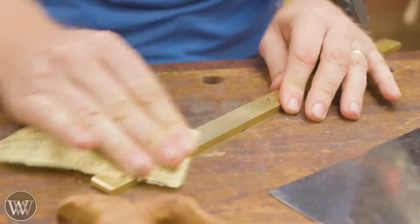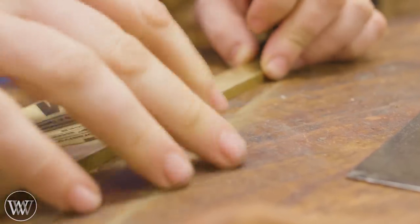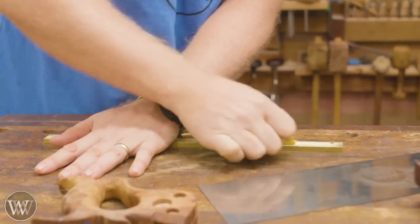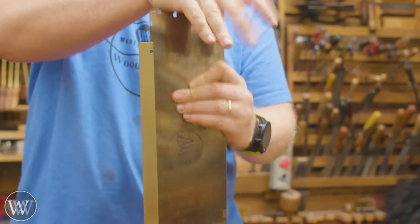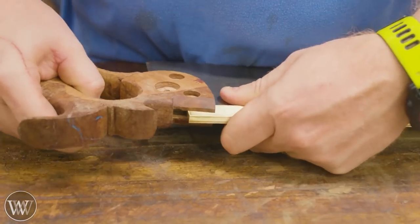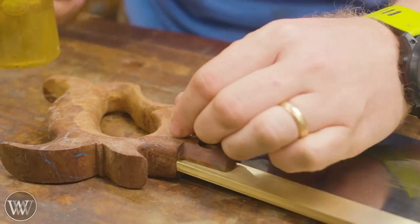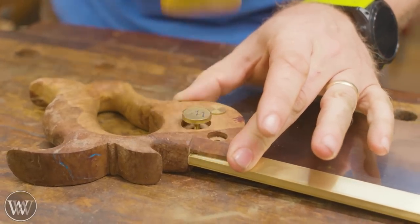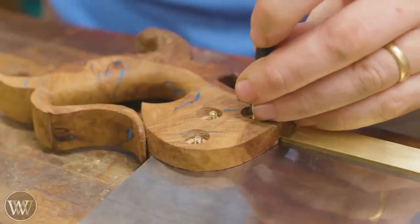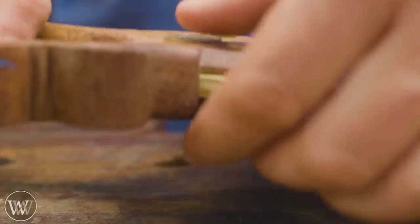I want nice, clean teeth on here. On mine I'm making it into a tenon saw. On the other two for Alex, I'm going to make those into a tenon saw and a sash saw - so a matching pair on those. The brass has oxidation on there, so I'm going to come in and sand that off with some 400 grit and leave a brushed look on there. This one is actually not a folded back - it's a cut back from Blackburn Toolworks, and I need to epoxy this one in place rather than pinching it down. Then we can drive in all the nuts and make sure we have a good tight fit. This one went out of alignment so I had to move things around to make sure it actually fit down in, then work things back and forth until it's right where I want it.